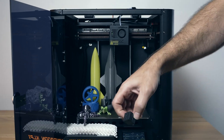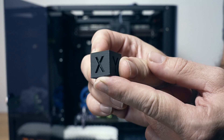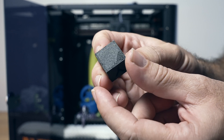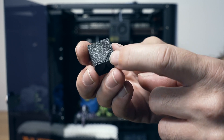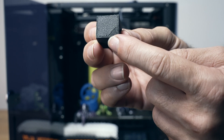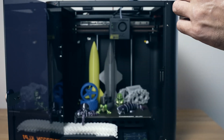We've seen the Benchy. After that we printed the calibration cube. Because it's a CoreXY machine this doesn't really mean much, but we can look at the faces — the X, the Y — the layers are all sitting very nicely. The bottom did have some missing material since it started printing with no filament, but other than that the bottom is very nice with the crinkled finished PEI sheet texture and the top is also beautiful. Calibration cube turned out very good.